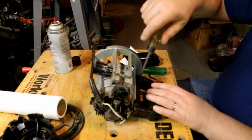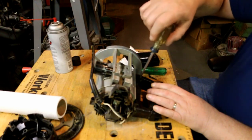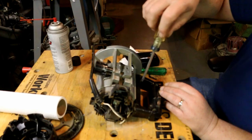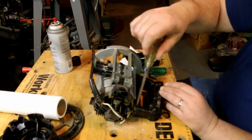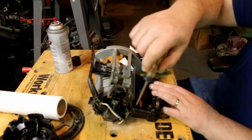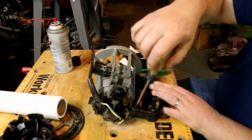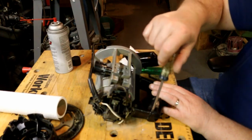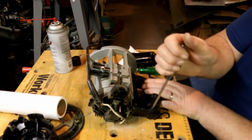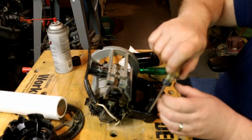And they can go flat when they're alive. Once they're dead, they're pretty crunchy, but when they're alive, they'll just flatten right out to about paper thin and crawl through almost anything. I had a bunch of concrete pavers piled up in the blacksmith shop. That's what I put on the floor. Plywood floor, cover it with concrete. Fill the joints with sand. No sparks get down in there. You don't burn down your blacksmith shop. That's my thinking anyways.